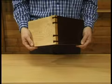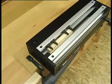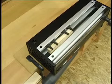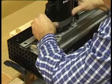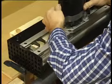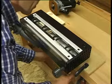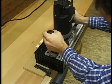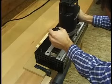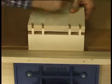Asymmetrically or irregularly spaced dovetails: should you use the jig to create boxes, the flexibility of the pin spacing will become apparent. It allows you to leave a wide tail that can subsequently be ripped through to create the lid of the box. When undertaking this procedure to cut the two opposite faces, the pin layout will have to be moved to the other end of the jig. The simplest way is to rotate a cut section over to the other end and duplicate the pin spacing. Replace the workpiece with the opposite member and route as normal. Not only are irregularly spaced dovetails used to create box lids — the varied spacing also allows a great amount of design creativity.